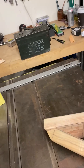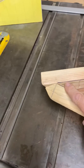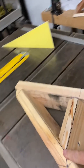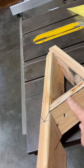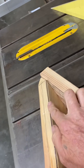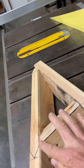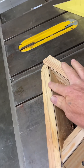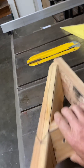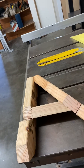This is how it stacks at the top. You'll notice the side of the rafter — which is the same side — flushes out with the heel stand. That is to say, the side of rafter, heel stand, side of the leading edge of the common rafter makes this incline triangle, which corresponds with this level triangle.